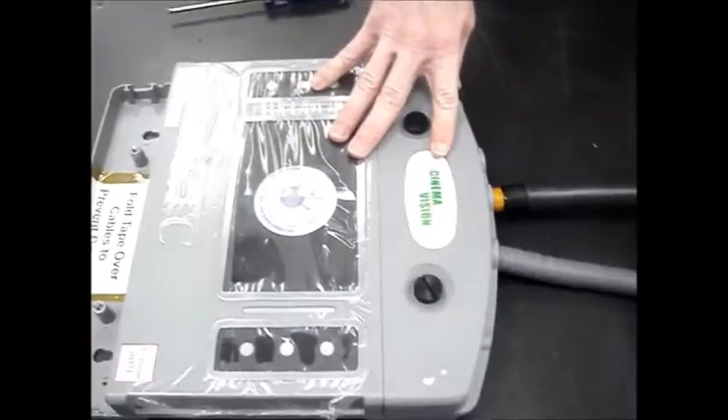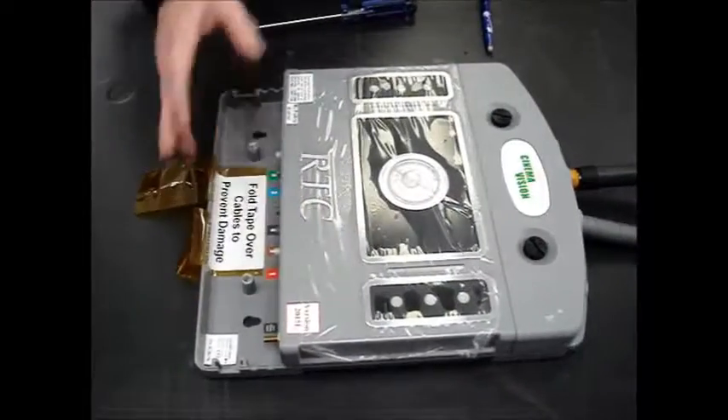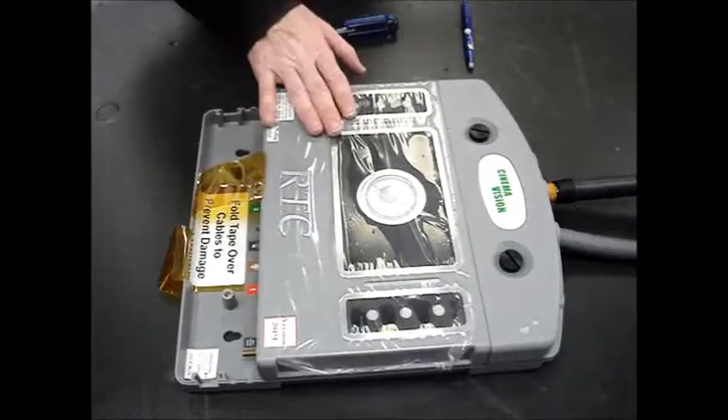After this, you are safe to take your headset, your visor, and your transducer back into the MRI room. Hook back up your fiber optics and your power cable, place your unit back on your transducer stand, and it is ready to service the customer.